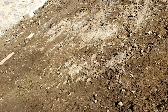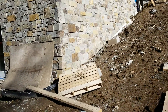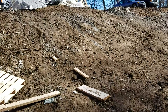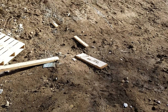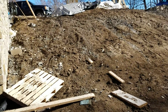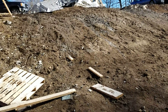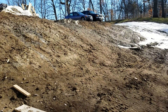Toward the end here it's going to step down, and it also has what I'll call slab steps — more like outcropping steps, kind of random. They'll be made out of bluestone, not the premium or regular bluestone we use, but actually jagged in nature — outcropping pieces. With nine feet of drop and assuming each step is six inches thick, that's going to be about 18 of them, and they meander rather than going straight, as you'll see in the drawing.